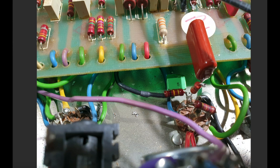And normally this thing runs up to the PCB here, and there's a 100K resistor that's up here. Right, I remove that 100K resistor, and I've moved it down here directly onto the pin. This is my 470 picofarad cap, which I talked about in the schematic, which bleeds off some of that high end on the cathode follower to ground.